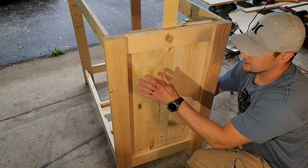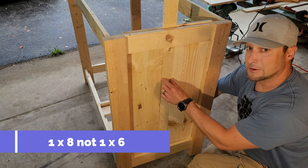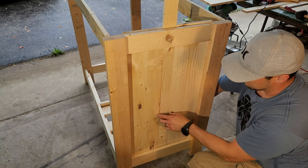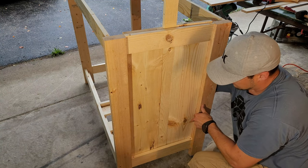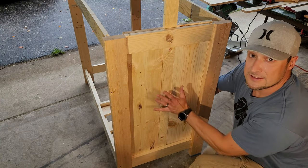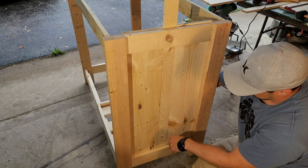So I should have told you — you've got your one-by-six and another one-by-six, but that leaves a three-inch gap, so I put a one-by-three in the middle. It actually makes it look pretty nice. I still have to attach and cut this one, then attach this side, and it'll be ready for stain.